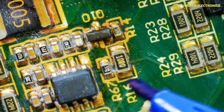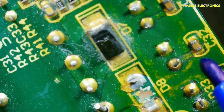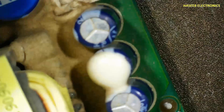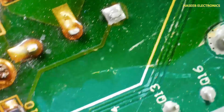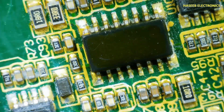When this standby section starts, this voltage line will turn on the PFC controller IC. On the output side, the secondary side has two windings — one and two. These two lines provide voltage to these capacitors and fan connector J8. So this 12 volt section will power up the secondary side PWM controller ICs.